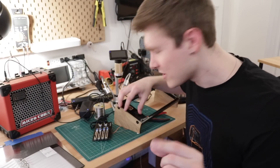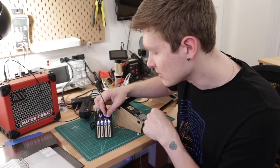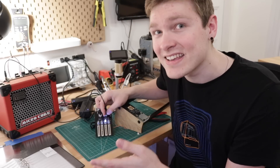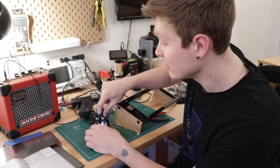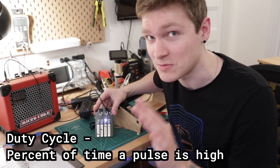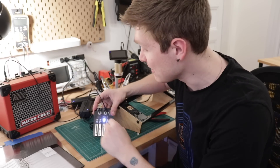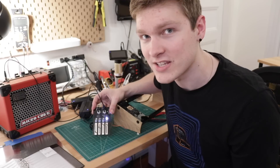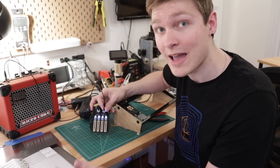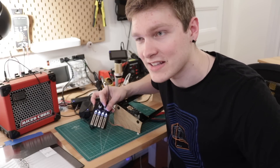That's weird. So here's a thought - when I turn my tempo up, the LEDs are lighting all four of them, but then when I turn it back down, only one will stay lit up. My guess is that when I turn this all the way down, my duty cycle is pretty much 100%. The decade counter never actually sees the high-to-low change because the 555 timer is high most of the time and it just never steps. But then when I change it, my duty cycle changes - there's a definitive high point and low point and the decade counter will click through. I'm going to hook it up to my scope and see if that's actually what's happening.